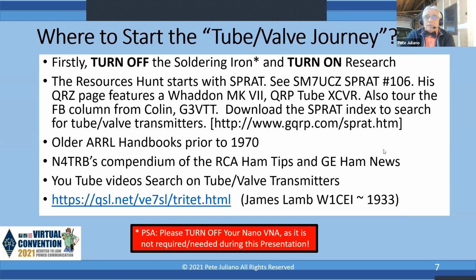Also visit YouTube and search on valve and tube transmitters. Lots of projects there. One particularly good site is in the link there from VE7SL Jim McDonald, and he covers the Tritet oscillator. The Tritet ruled the roost from the 30s through the 40s and 50s, and was really quite popular because it's a combination oscillator. Part of the tube is used as a triode and part of the tube is used as a tetrode. It was very, very popular. And Jim does an amazing job. You'll see he built a one tube transmitter that he has operating on 10 meters because this particular transmitter topology is very good for harmonic operation.